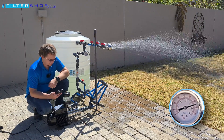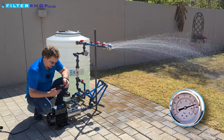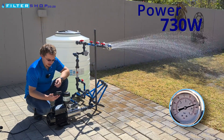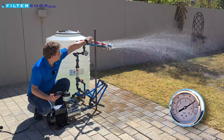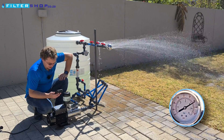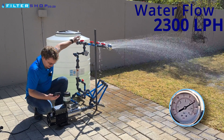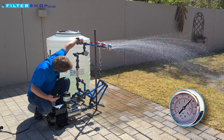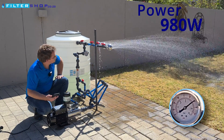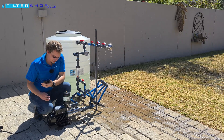Adding a second shower — we're now a bit over about 1,500 liters an hour, the pump side shows about 4.5 bar, and we're drawing 730 watts. Adding a third shower — 975 watts at 2,300 liters per hour and we're still managing to keep the pressure. At 2,500 liters an hour it's at 980 watts. So that's actually doable at 4.5 bar still.